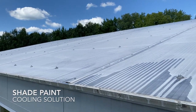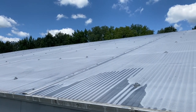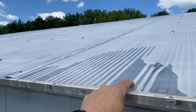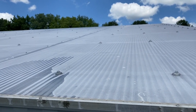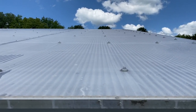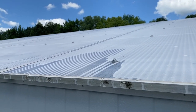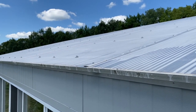Around June she saw temperatures were starting to rise, so she began with shade paint as one stage of her cooling system. As you can see here, some glazing didn't get the shade paint and some did. The majority of the roof is covered in shade paint. The idea is that we can reduce thermal loading — heat transferring into the greenhouse — by a larger percentage than the light we eliminate. Maybe 7% of light is lost but 14% of thermal loading is lost, so it's a net gain for cooling.